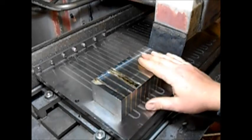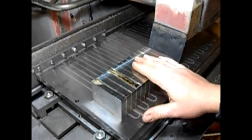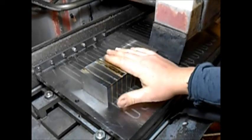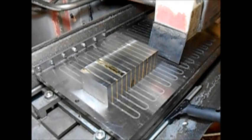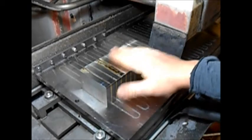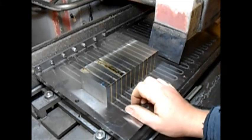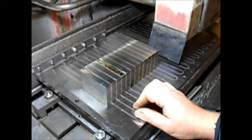And then we can start grinding the block square — I'll show you some tricks for grinding the block dead square, and how to measure it. There are a few videos on YouTube, but I'll show how to measure for square without having a reference to work from. I actually have a couple of granite squares there, but I can show you how to use it with the granite square, and also how to measure it without the granite square — as long as you've got a grinder that you know grinds parallel, which it will as long as you grind your chuck. You can test for square without needing a reference. Anyway, thanks for watching — stay tuned for more.